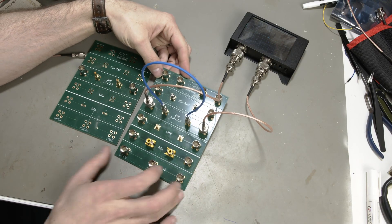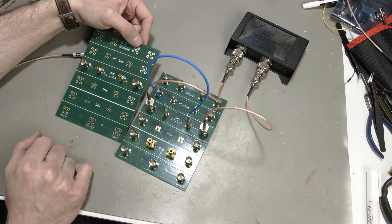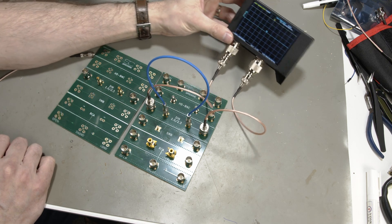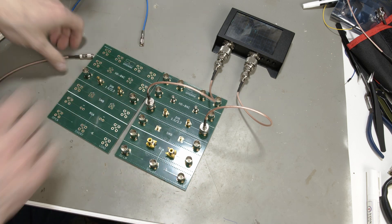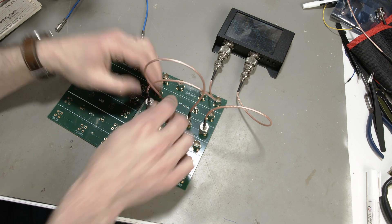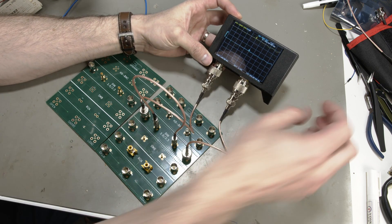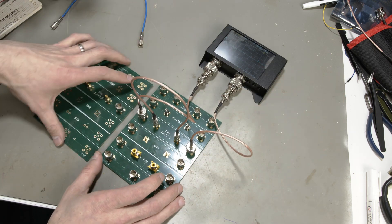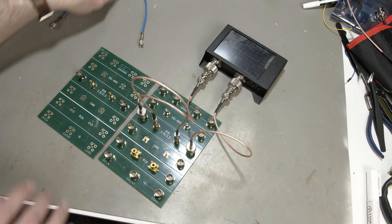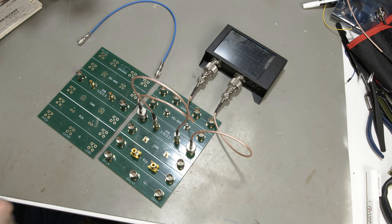I have the original board that I made and I put two of the cheaper connectors on it with the same BNC connectors. Electrically everything's okay here — you can look at my VNA. Here we have a calibrated completely flat response from one megahertz to two gigahertz. If I swap this cable out for one of the DIN ones — one of the cheaper Chinese ones; I've tested five of these — it's flat. It's pretty flat, it's flat enough for me. The biggest dip is around 1.5 GHz where it's 1.8 dB down. That's okay, it's perfectly fine from an electrical perspective. I've tried combinations of my gold standard Amphenol American cable versus this cable on this board versus that board and electrically everything's fine.